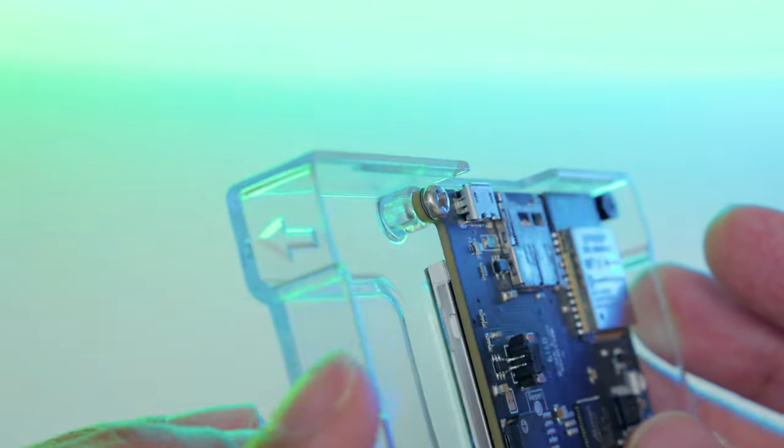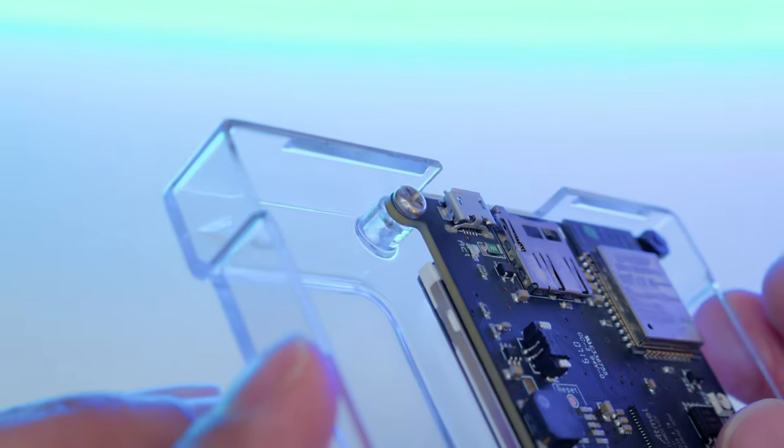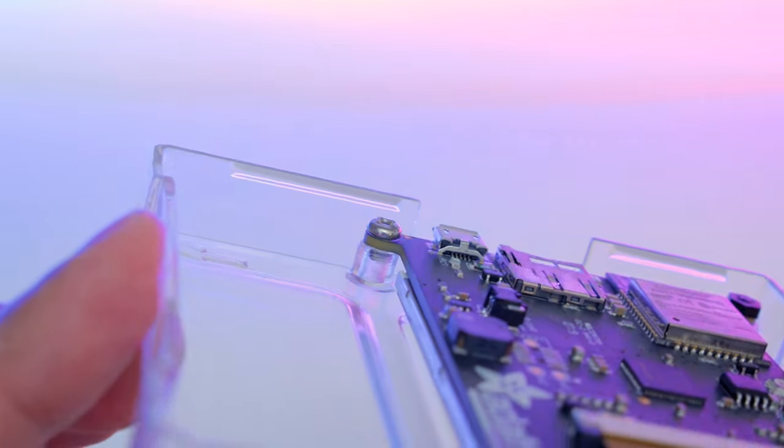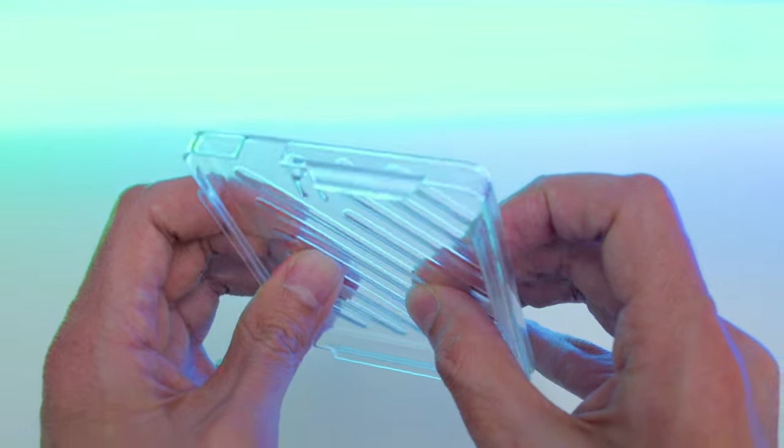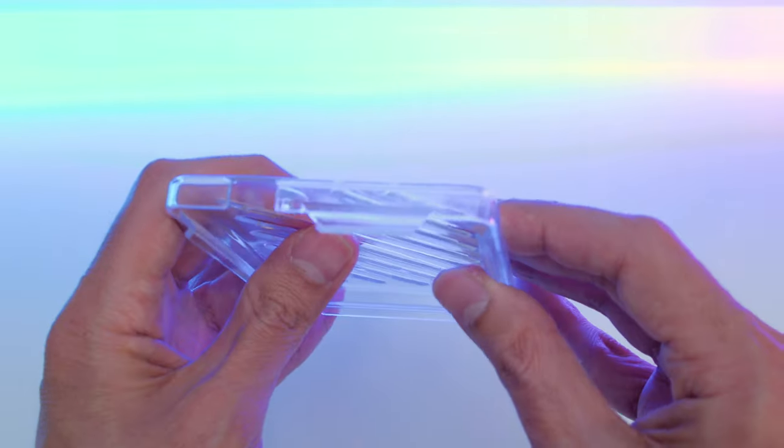If your parts feature standoffs with mounting holes, be sure to make them slightly undersized so you can use a screw tap to create the threads. Parts like this back cover have a noticeable flex to them that allow them to bend slightly.